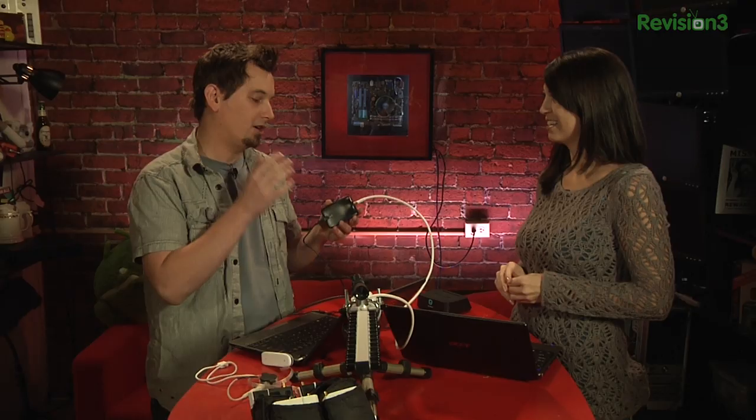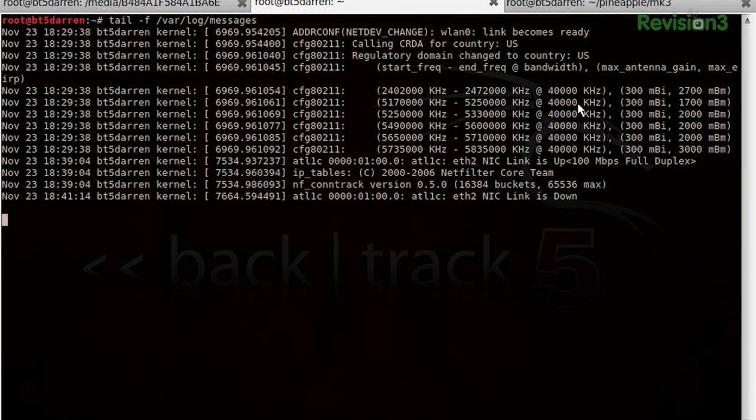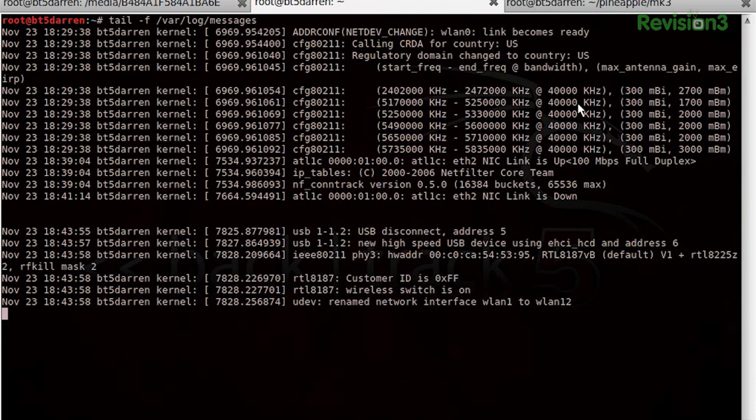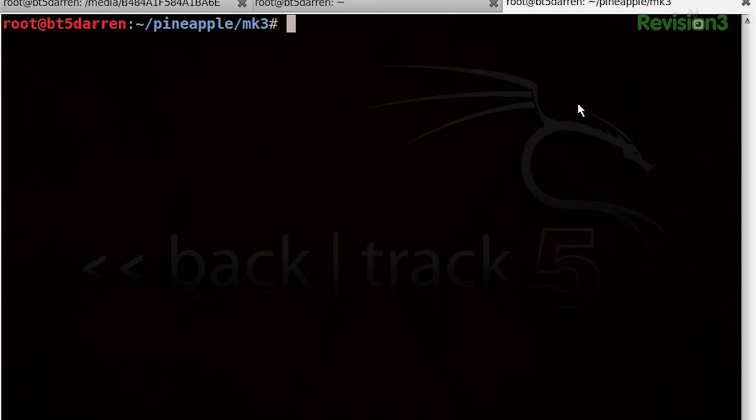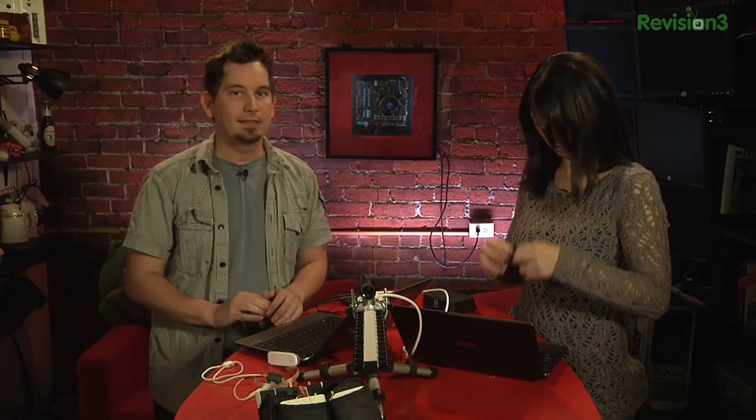He's implying that I'm running my radio outside of U.S. spec and thus breaking the law. But I'm actually not. This device is FCC Part 15, meaning it complies with all those fun rules — it's regulated in the U.S. Let me show you: if I unplug my radio and plug it back in, I now have WLAN12, and I can bring up that interface. Running iwconfig WLAN12, you can see my TX power is 27 dBm, which translates to 500 milliwatts — the legal limit in the United States.